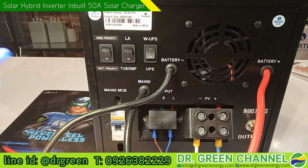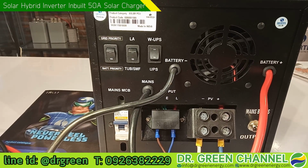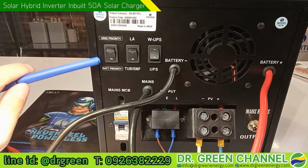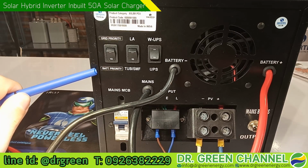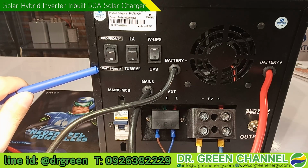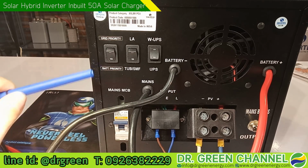For the dip switch over here, it is required just the first time to configure the inverter to fit your deployment use case. Let's see one by one. On the left-hand side here is the priority switch, with which you can choose whether to maximize the usage of the solar power. It will keep using the power from the sun, and once the sun sets, it can still continue to use the power from the battery to supply the loads until a certain threshold, and then it will switch to the grid power.